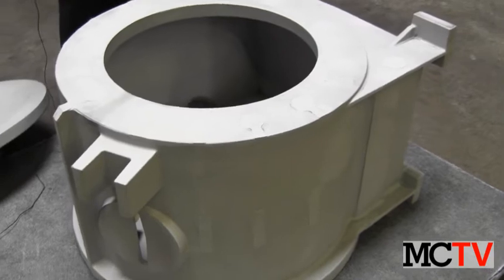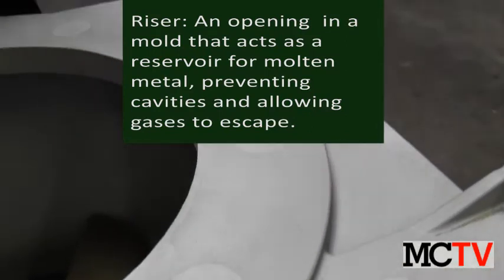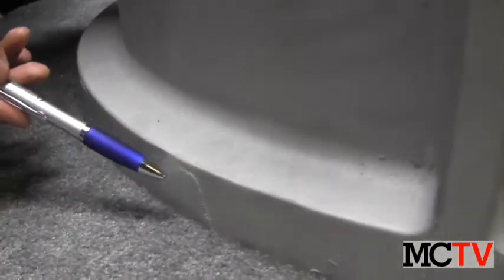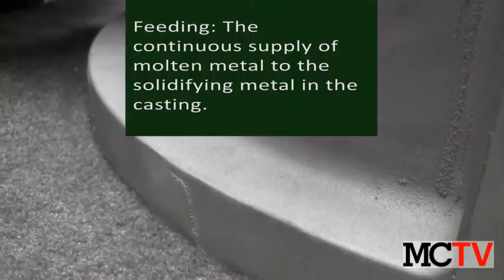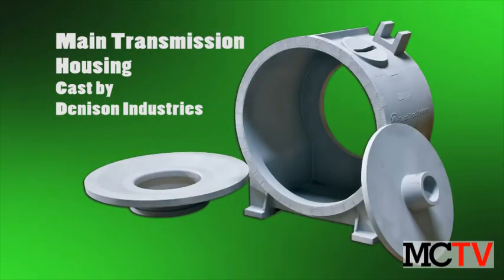As you can see over here, these are where the risers were attached at multiple locations. Also, if you can see on the bottom flange, this is where the metal was entered into the cavity with the side riser gated through connections, and therefore you can feed the flange — which is a critical area from the stresses and from the leak-proof point of view regarding soundness. So this is an example of an engineered component with tough requirements for soundness, surface finish, and dimensional tolerance.